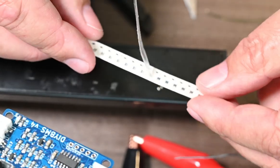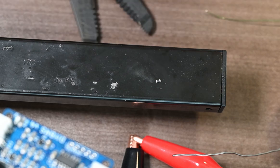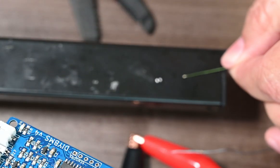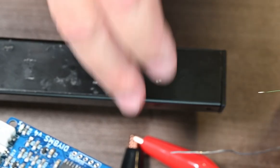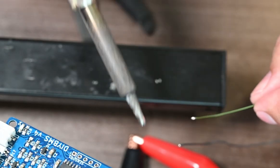And so here, you've got several thermistors, and of course these are 805s, so they're very tiny, they're hard to work with. But what you want to do is take the enamel wire and take the tip and take like an X-Acto knife or something and scrape that enamel off. That way you'll get a good connection to it and the solder will stick. And then you just want to tin up the tip of the wire. And just want to get a dab on there.